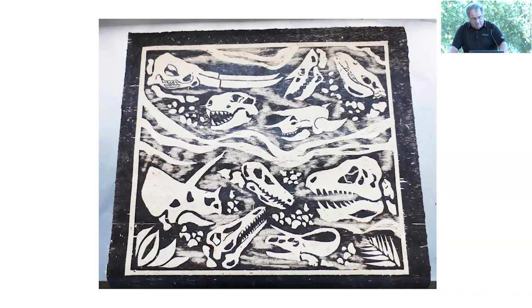On the outside, the frame area, I didn't want that much grain, so I coated the outside frame with 3 coats of polyurethane to knock the grain down a little bit. I wanted the outside frame to be a little more of a flat black area, and then have all that grain on the inside, which is where the main focus should be.